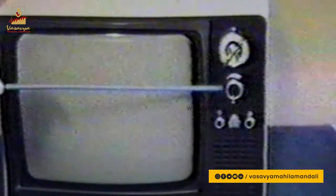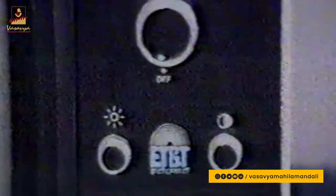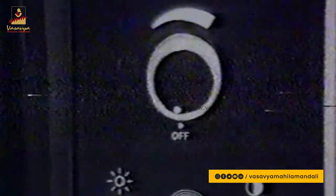The choice of controls has been done with great care. The volume control knob, which many competitor sets provide the same size as the brightness and contrast control, has been changed — we have a larger control for volume, and it is physically located away from the brightness and contrast control. While the set is being used at home, the user would normally select a channel or tune it but keep brightness and contrast to his choice. Hence, the volume control knob has been chosen of a larger size to ease the user's convenience, and an external disturbance of the contrast and brightness control is avoided by making the volume control bolder.